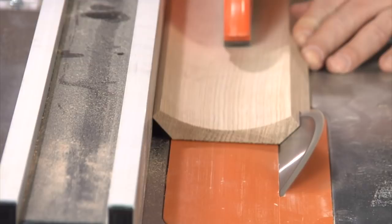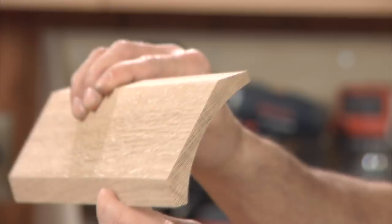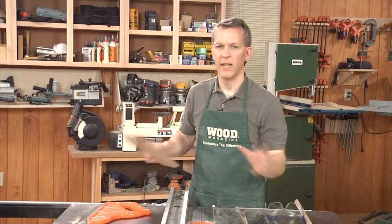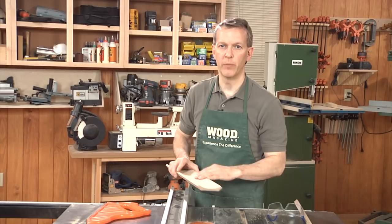There's the final profile, and when you're ready to put it on top of your cabinet, it sits about like that. One tip: when making molding for a cabinet, don't just make enough — make at least one piece more than you think you'll need. It's much better to have one extra piece than to end up a little short and try to duplicate a setup, because you'll never get it exactly the same.